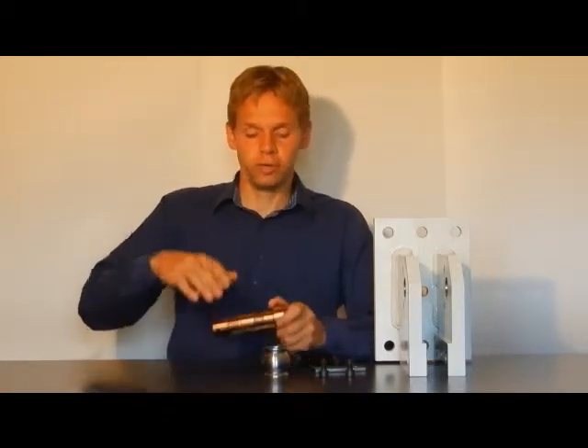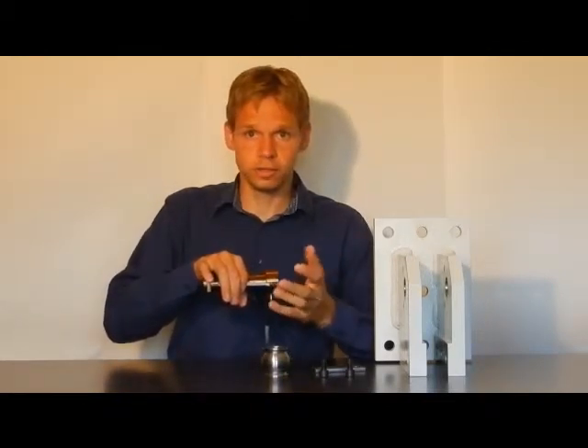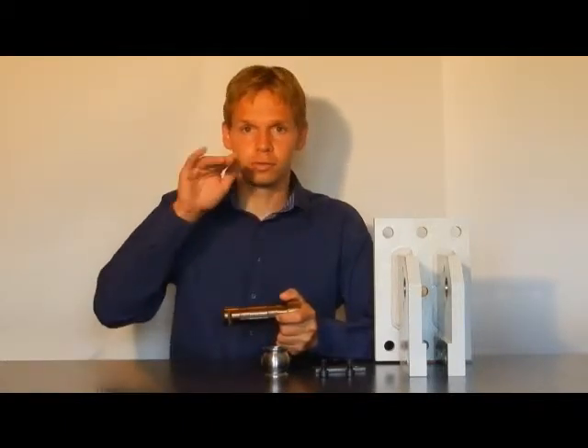The same approach applies for 20 mA using the scale function. With a load of 10 tons on the load pin, you connect the scale wire to 24 V for 5 seconds, and then the signal rises to 20 mA.